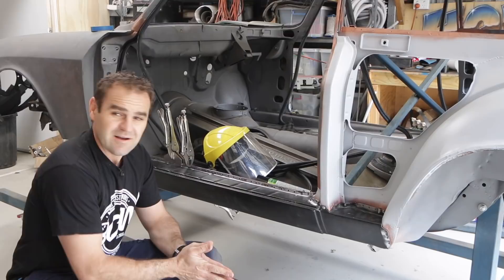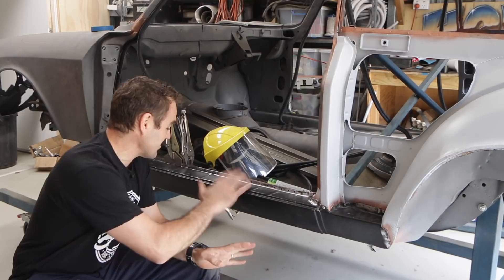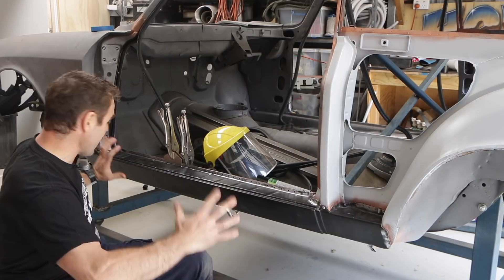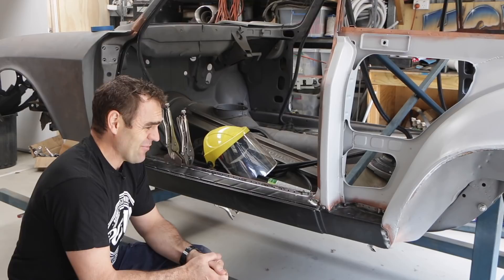It's been a long time coming but it is finally time to start welding these parts on. I've gone through, I've cleaned the paint off all of the edges where I'm going to be welding. There's weld-through primer on all the other bits on the underside. Everything's painted inside and out, ready to go. It's all lined up — I hope in the exact right spot it needs to be. I spent so much time on this, it would really suck if I had to cut it off again.